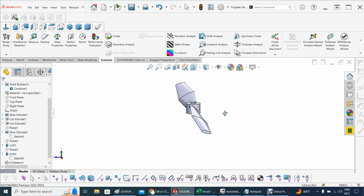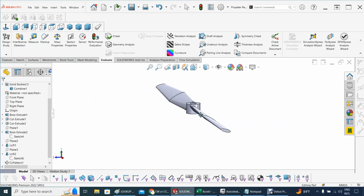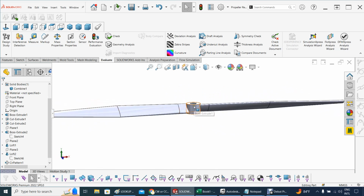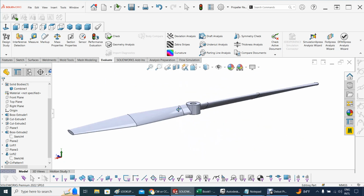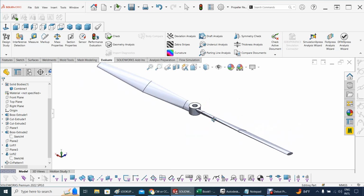The motor can spin either clockwise or counterclockwise, but the design of your propeller, in this case, was created to spin clockwise. If you use a self-locking nut, it shouldn't be a problem. But if you don't have that and you have to use the cone-shaped nut that sometimes comes with the motor, then that might be an issue, because a regular nut turns clockwise to get tight, and if the propeller is also spinning clockwise, it might get loose. You don't want that, particularly in a multi-rotor system.